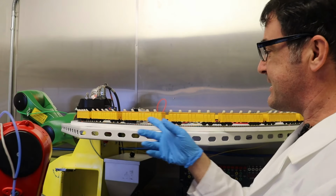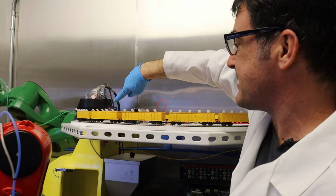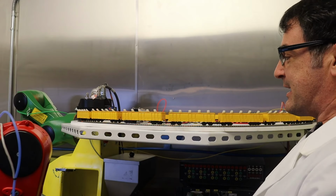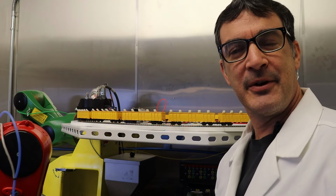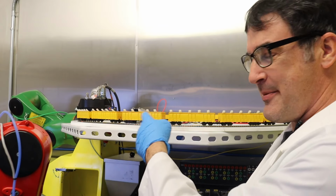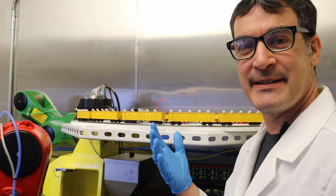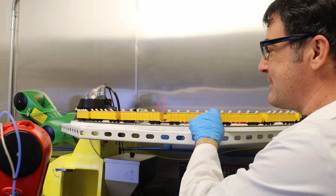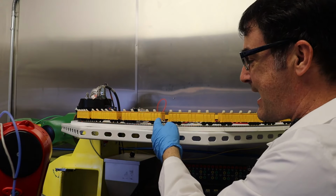So in this setup, I had to program the robot to control these train cars using a couple of optical sensors over here, which are Keyence optical sensors. And effectively, because of coupler slack in the cars themselves, which my friend John SL from YouTube, he visited about 6 months ago, and I was telling him about doing the model train conveying system, and he warned me about coupler slack, which is a thing that happens with actual real size trains as well, where the train cars basically don't hold their position perfectly, but they'll actually just stop due to the tolerance of the slack in each coupler.